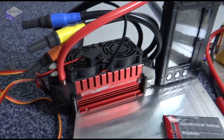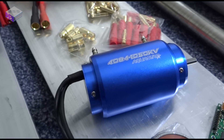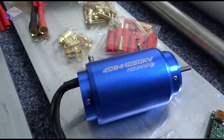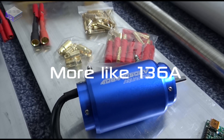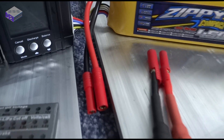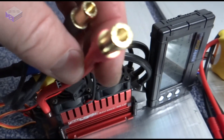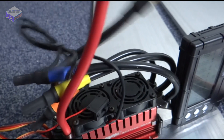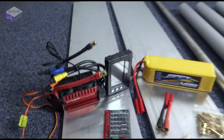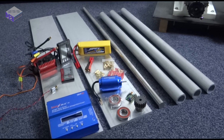The ESC is capable of 200 amps and that's a 3 kilowatt motor — 3 kilowatts divided by 22 volts is probably about 120 amps that it's going to pull, so the ESC and battery should both be more than capable. I've decided to go for these large, chunkier connections because that's what's fitted to the ESC through 8 AWG cabling, and I want to keep them as short as possible. Hopefully we're starting to get to the testing phase.